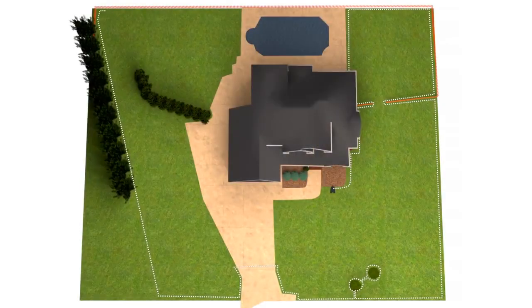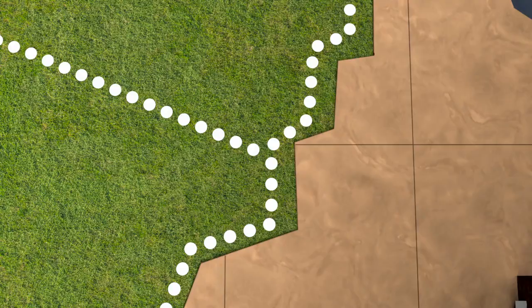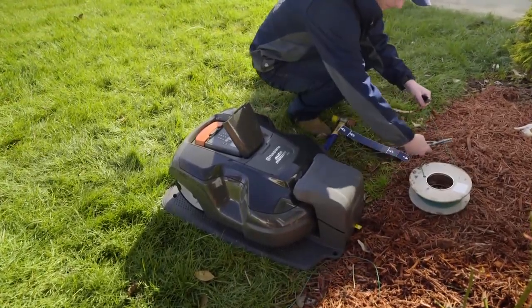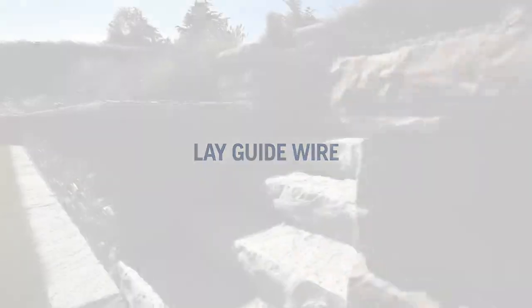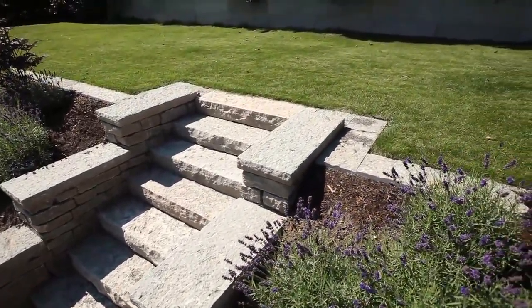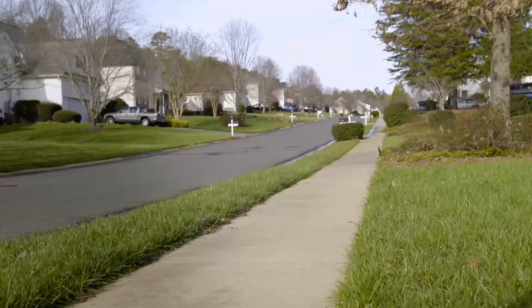Our recommendation is to create a sketch of your yard before you start. The guide wire later needs to be connected with the boundary wire — if you have pre-planned this spot, you can leave a 4-inch loop at this location and the connection will be much easier. When you finish the boundary wire and return to the charging station, leave 2 feet extra wire and cut. Now you know the basics of how to place the boundary wire. If you run into obstacles you don't know how to handle, like fenced areas or narrow passages, this will be handled in the chapter Advanced Installation.